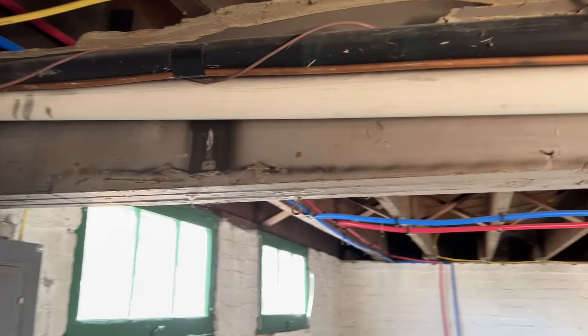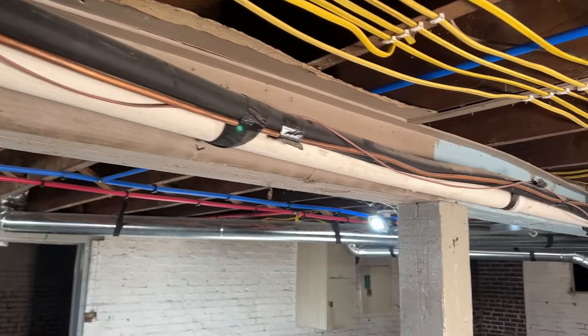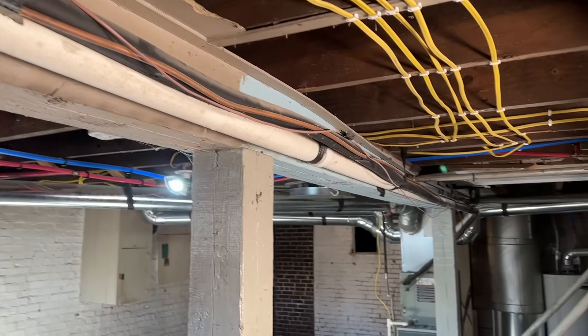I actually purposely drilled this hole in the pipe because it was really cold outside. We were doing a project where we needed the drywall mud to set up. We were starting to paint and I needed heat in the house, but the furnace would continue to cycle. What was going on is the pipe going outside — the outlet is actually higher than the inlet, so the moisture was starting to pool in a low point in the vent.